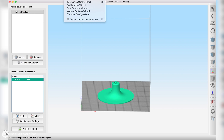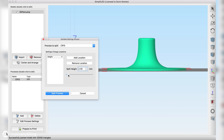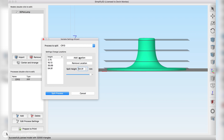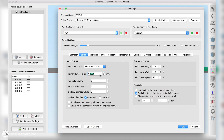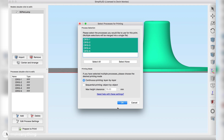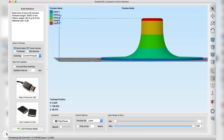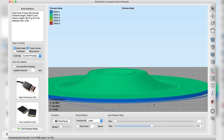The model looks good, so I'll export that as an STL file and bring it into my slicer, Simplify 3D. This shape is pretty easy to print with standard settings, but since Simplify 3D has this new variable setting wizard, I'm going to use that to split this part into several processes. This allows me to vary the layer height at different points — I can use 0.3 millimeter layers for the parts that are essentially just a vertical cylinder, and a much lower 0.1 millimeter layer height for those shallow slopes, gradually increasing as we go up the curved shape. You can see how the processes are split up when I preview the G-code — that blue section has the thicker 0.3 mm layers while the shallow slope has the 0.1 mm height.